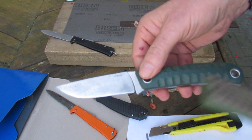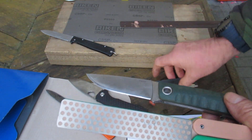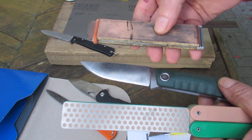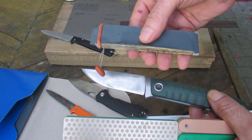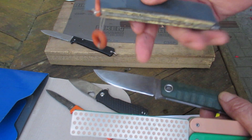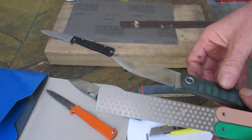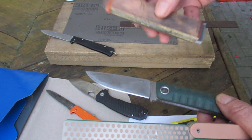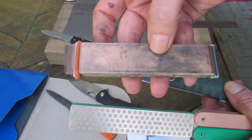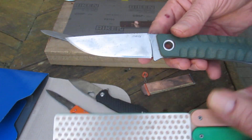So it's a simple test. The 8,000 grit DMT stone is not able to produce as smooth a surface as ordinary 2,500 grit sandpaper or the 3,000 grit diamond film. The diamond film will polish it out faster than the sandpaper, but trying to get hold of diamond film in New Zealand is next to impossible — they won't even bring it in; you've got to get it from America directly.